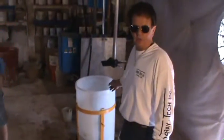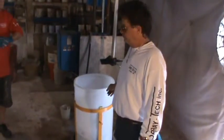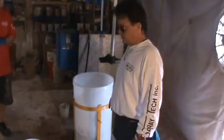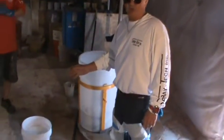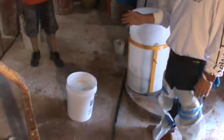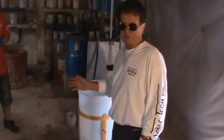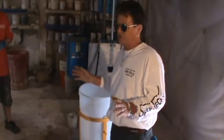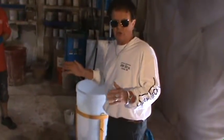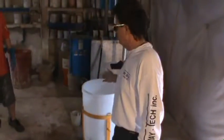Of water or a polymer in now. We've got our 25 pounds of water. We've got our 94 pounds of sand. We got 4% 3/4 inch fiber. For the industry to know, the half inch and the inch and a quarter does not really do anything. Half inch fiber should not be used for premix. But the testing we've done, 3/4 at 4% has given us the highest strengths. You know that by doing test strips and sending them to Allied Testing. Let's go ahead and mix the batch.